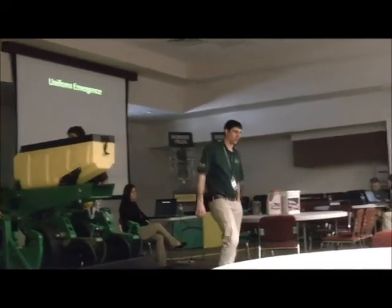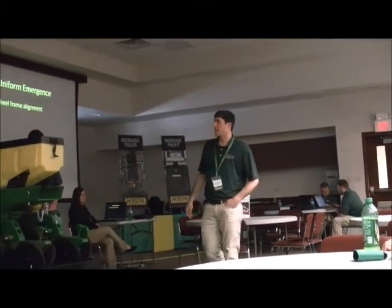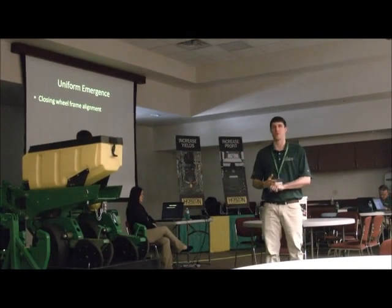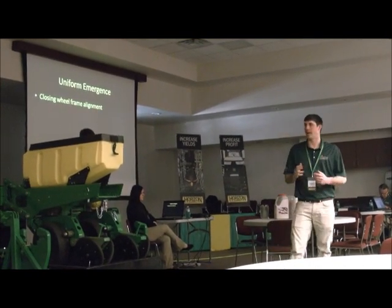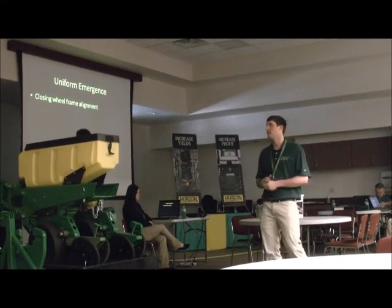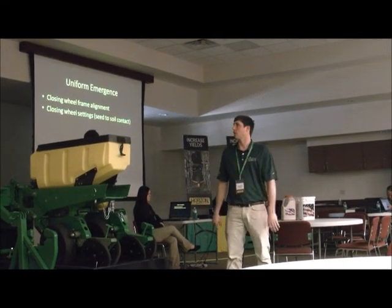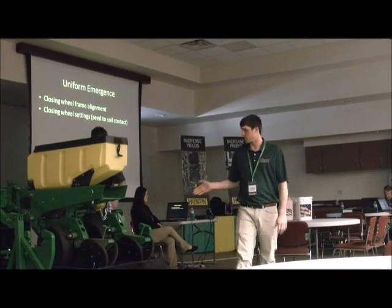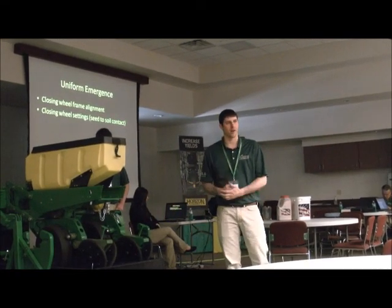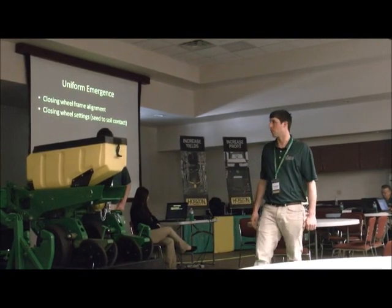Next, we're going to talk about uniform emergence. Everything these guys talked about, seed depth, seed spacing, everything leads up to emergence, when that plant actually comes up, if the crop's coming up evenly, if we're getting a full stand. Some other things besides what they talked about that go along with that is closing wheel frame alignment. We want to make sure that closing wheel is centered over that seed trench. We don't want to drop a wheel in there and pack that soil too tight on that seed so it has to work to get through the soil.